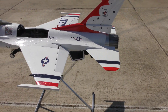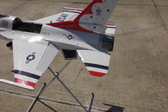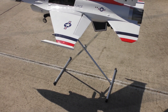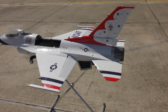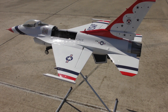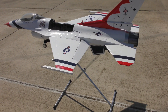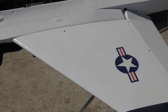I am flying this with taileron, so if I hit aileron you can see that my tail moves. I think I like that especially with flapperons, because in the past with flapperons the plane gets lazy on the roll axis. With taileron, it flies really good. I'm really liking this amount of flapperon. This flight took off beautifully. I'm still doing some tuning — I need to tune my Smooth Flight unit, as the gains on the ailerons are a little bit high, so I'm going to bring those back down.